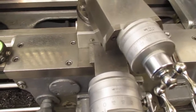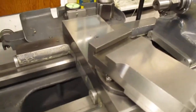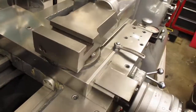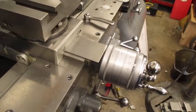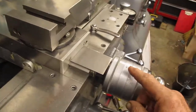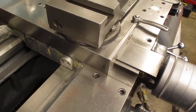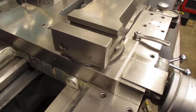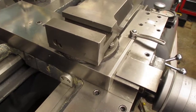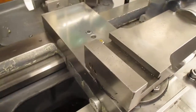What I was going to talk about is the cross-feed screw and lubricating it. The machine automatically lubricates just about everything in the apron, and it even lubricates the dial. But it does not lubricate the cross-feed screw. And the cross-feed screw is really hard to get to — you almost have to take the machine apart to see it. But there's a fix for that.